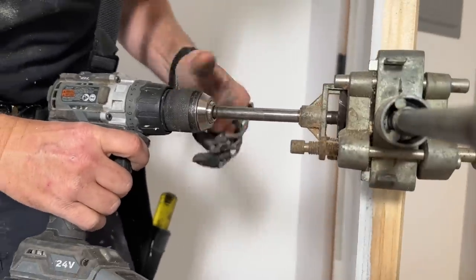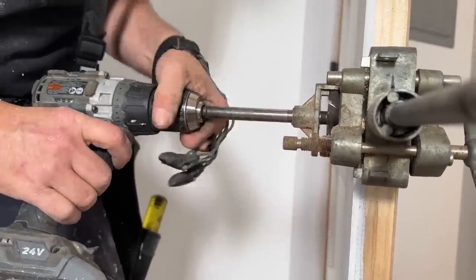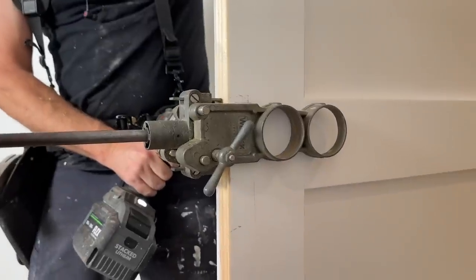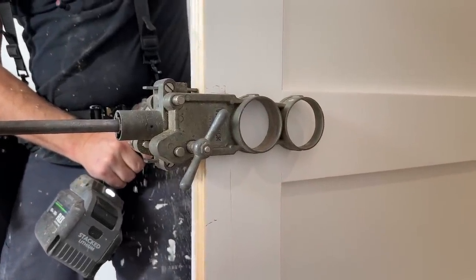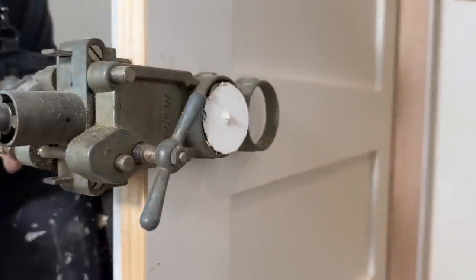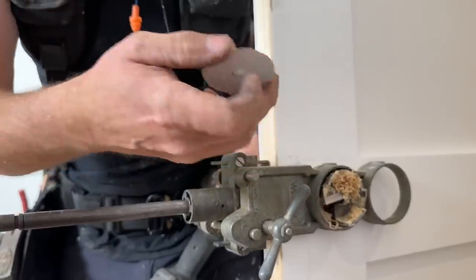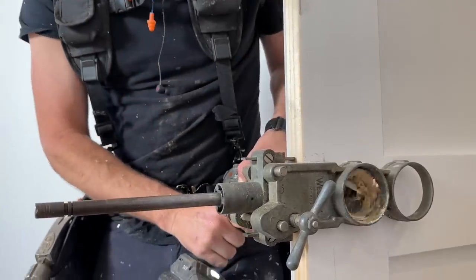It had a quick adapter that I don't have, so I'm just chucking the shank here. It had like a square drive. Alright, she's spinning. You ready? Oh yeah, that sounds sharp. So the bit is working properly now — these teeth score deeper than that big chisel cutter. You have to score deeper first, or it'll blow out. Yeah, or it just won't drill really.